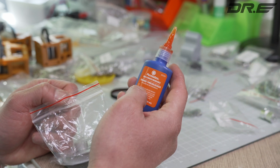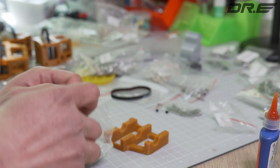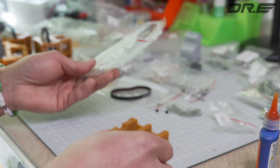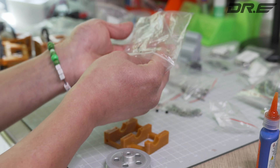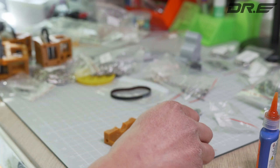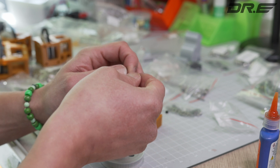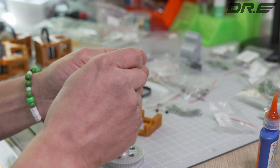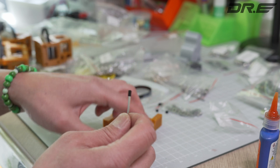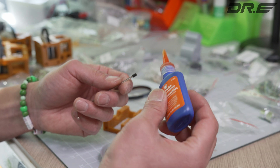It's not permanent, but it's removable, and it's much stronger than blue. I used to build a lot of electric skateboards, so I was using blue and it would always come off. With electric skateboards you're dealing with way more vibration and impact, but 3D printing does use quite a bit of vibration if you go fast.